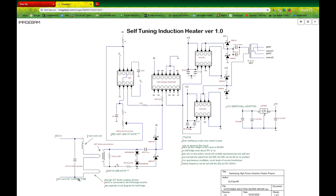What ends up happening is that there is a current transformer which picks up the signal — picks up some of the energy. And when there are very high currents, there's a lot of energy being picked up. So this has to be reduced to a manageable level so it can be fed back into the hex inverter.